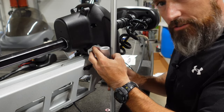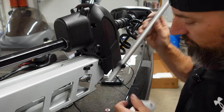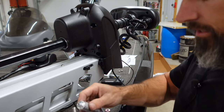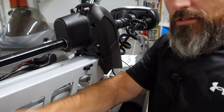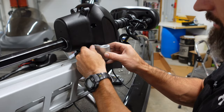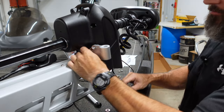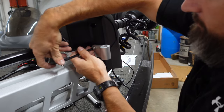Mine does go — I think I can still mount mine right here on the inside; it's gonna go down and hit right there. I think whoever had this boat before me had the same trolling motor because you can see an indent right here on my carpet. I'm going to mount mine there, and like I said you could mount it on the other side if you want. I'm going to put a little anti-seize on these. Make sure you don't forget that little lock nut — mount this right in here, and your quarter-inch allen is gonna work to tighten that up. Put your lock washer on.